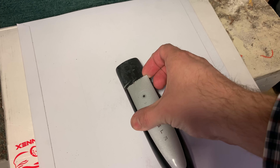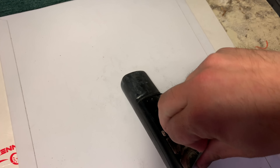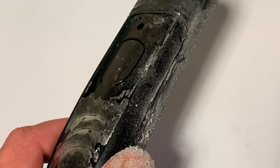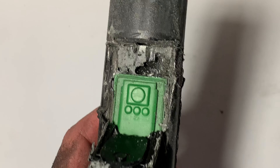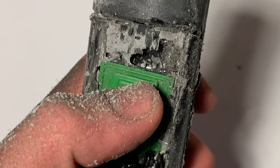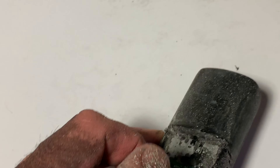Moving on to the handle, there's no seams at all. I cut it a little bit and was able to pull back the adhesive top. There's a break in the plastic under the button and you can see a little green below, so something's in there. When I was cutting in with the Dremel, the dust changed from black to gray, which means I struck potting — something poured in and hardened that makes things invincible and heavy, protecting the electronics inside from moisture.